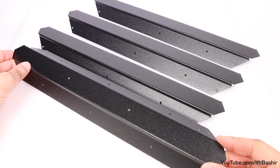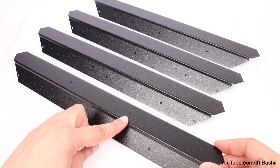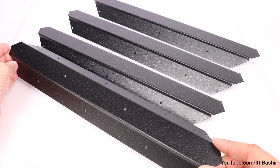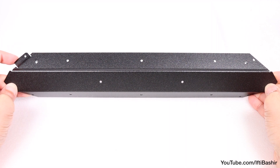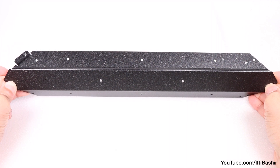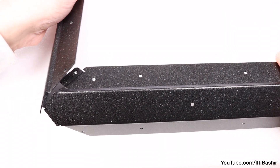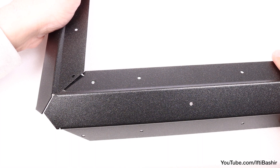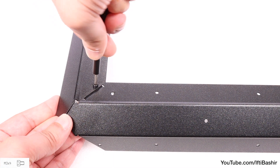There are a final four edge profiles remaining in the package. The profile with the two small openings in the middle sits on the back of the printer's frame. Starting with this piece, orientate it so the protruding flange faces the top left corner, then place another profile on this side so the flange slides in underneath the left profile, securing with a single M3x4 screw.